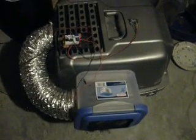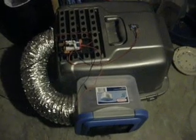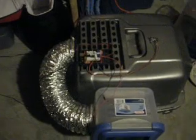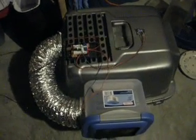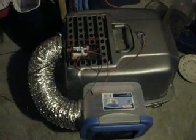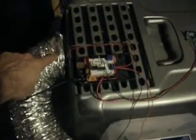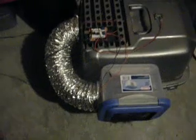As long as the sum of that array is above 0, I'm going to assume the cats are still in there and not turn on that second fan. Once that sum goes down to 0, it will go into a delay for about a minute and then kick on that inside fan — this one here — and the outside fan will also stay on for another five minutes.